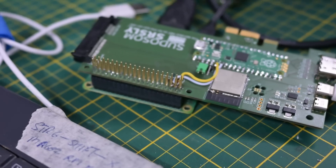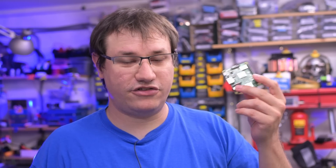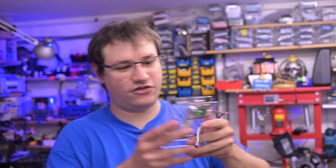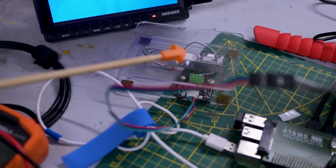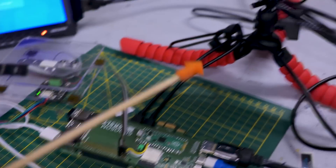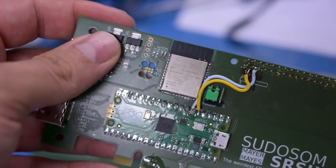I've heard there is a broken I2C implementation on the Pi 5, but not the Pi 4. I also tried a Pi 3A that I know has working I2C — I've used it in previous projects. It has the old Raspbian with a working I2C implementation, no software quirks, and that also could not detect it. I tried another I2C device and that one was detected by one but not the other, so there could still be something wrong in the board design. Let's solder in some bodge wires and try again.